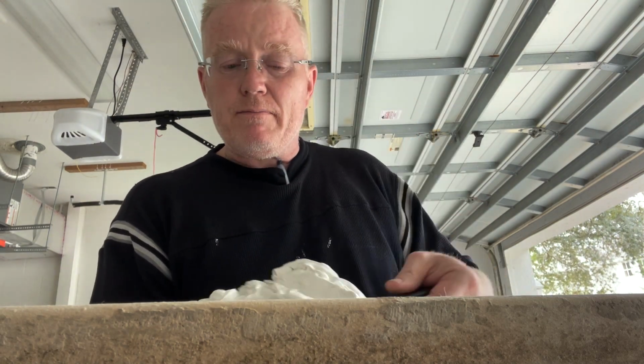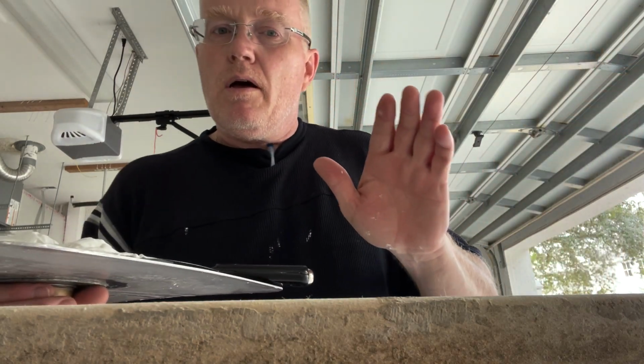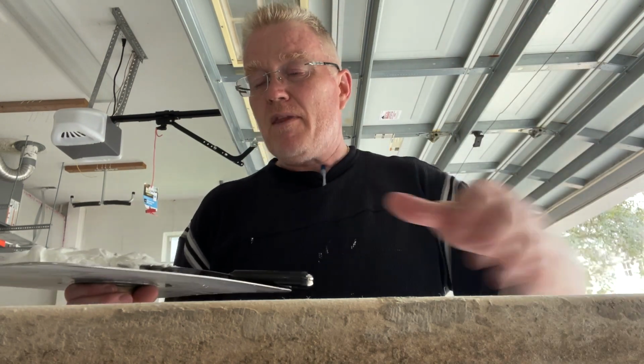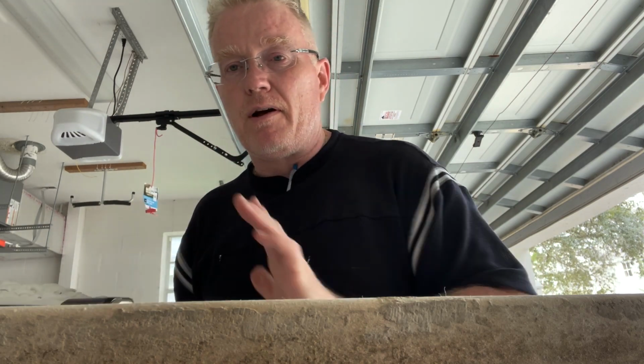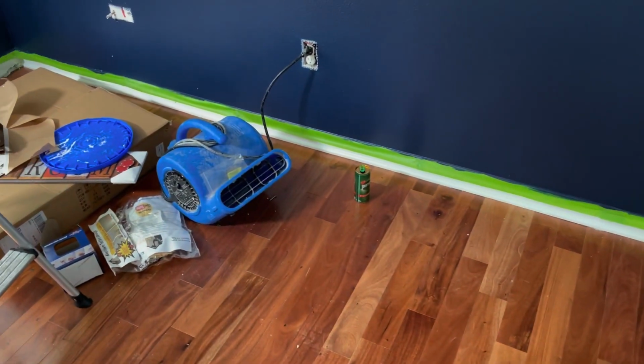If this is too dry, you may pull your curing compound that's already on the wall. Then you create another mess. The wetter this is, the less you'll disturb the compound that's curing on the wall. Let's go in and see what I'm talking about. Now our fan stays on. We grab a cup of coffee and we see that our dark spots are indeed in need of curing.